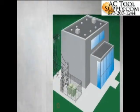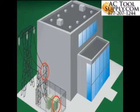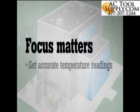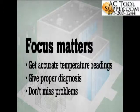Well, these passive autofocus systems often don't know, but the new Fluke infrared cameras with Laser Sharp Autofocus do. Every infrared camera user knows that focus is the single most important thing to ensure when conducting an infrared inspection. Without an in-focus image, temperature measurements are often not as accurate — sometimes by as much as 20 degrees — and out-of-focus images make it much easier to miss a problem.